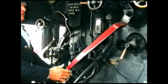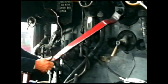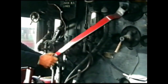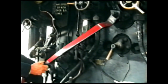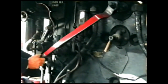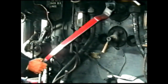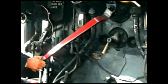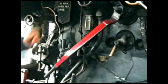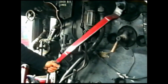In many cases, the general operation when starting with a large train is to raise the regulator until the locomotive starts moving, close it immediately, then reopen it again, for the simple reason that it will take 50 to 100 times more energy to start a train from static and get the wheels moving than it will when the train is rolling. So it is firm, it is constant, but it is slow operation when you open it. When you close it, no problem — you can slam the regulator down onto the block without any problems whatsoever. The regulator is the equivalent of the car accelerator.